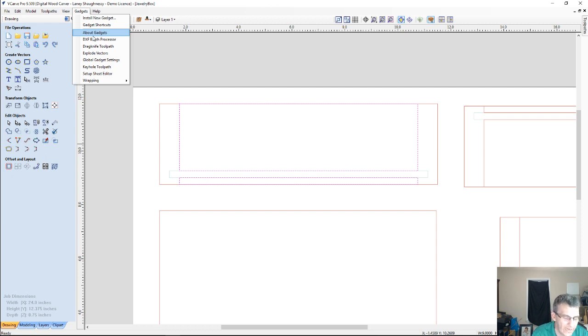But we talked about this the other night when I was on the Dave Gatton show, if any of you watched or participated. You want to use your tools the best way. Even though we can cut the miters and the chamfer on the CNC, it would be best to take these parts after they've been milled over to our chop saw or table saw to cut the 45-degree chamfers on them. So I'm not going to go over that tonight.